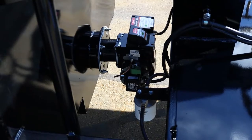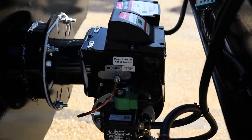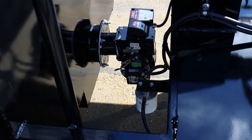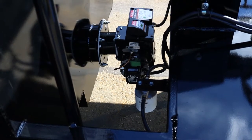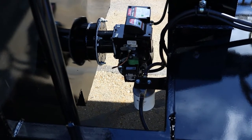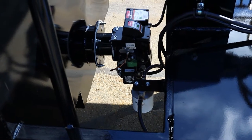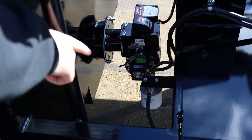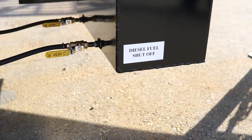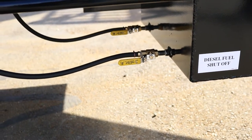This is an oil jacketed unit, powered with a single 320,000 BTU diesel burner — a Beckett burner. There's a pressure gauge down there so you can monitor what kind of fuel pressure you're getting, kind of an indicator to tell you if the burner's on because it is fairly quiet. You have a single diesel burner fuel filter, and then there are also ball valves underneath the fuel tank for on/off control.